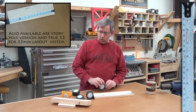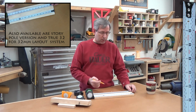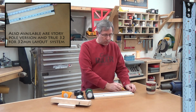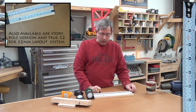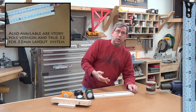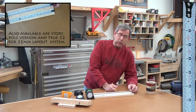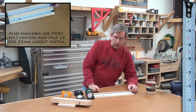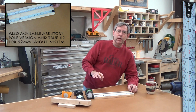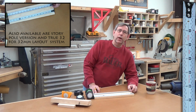The tape that I talked about earlier is my lefty righty, the standard reverse. So no matter which way you're looking at it, the numbers are facing you. If I'm on this side, I'm not reading them upside down. This tape also has markings on it down to a 1/16 of an inch. So it actually has 5/8, 3/4, 7/8, 15/16. You can read that. In some cases, that's a little busy for me, and it makes the tape a little tougher to read in low light conditions.